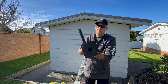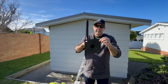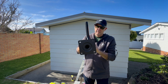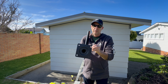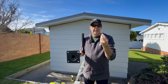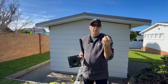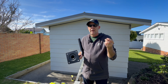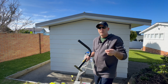You can see with the pole there is a bit of variation where you can manoeuvre it around if you're not dead-on with the holes in the right place. There's a bit of vertical movement and a bit of horizontal as well. I'm going to be attaching using these, which hopefully should be strong enough. I wanted to get stainless steel ones — trying to get something thicker than this but not incredibly long in stainless steel is quite tricky. I couldn't find it in our hardware stores unless I wanted to buy 100 of them, so I'll start drilling some holes and get this attached.